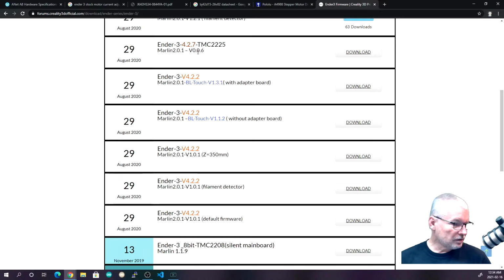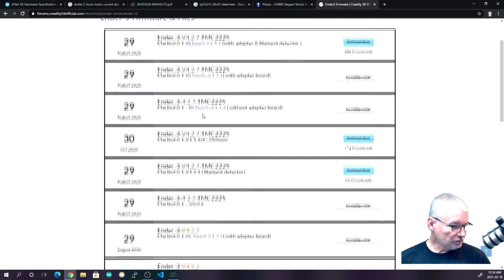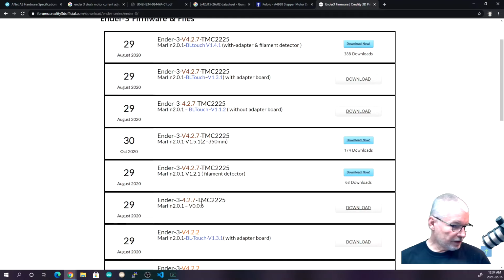Now make sure you get the right one. The board we have is the 4.2.7, not the 4.2.2. That's a very different board. So this is the one we've already got, so we don't want that one again. Now we've got a number of different types, and you want to make sure you get the correct one. This one has a filament detector. We don't have a filament detector.